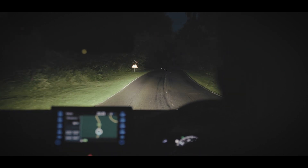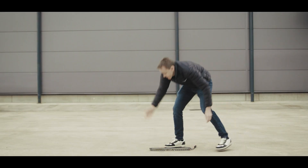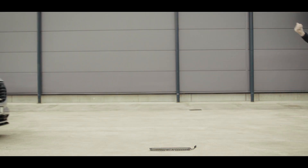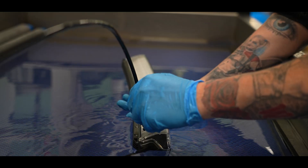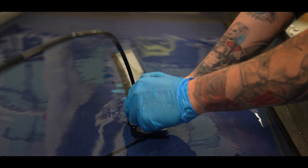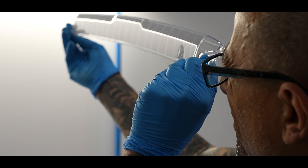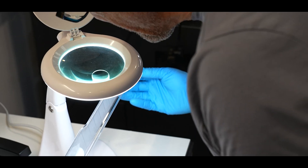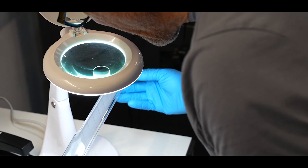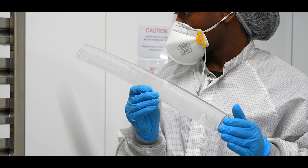Glide comes with a five-year warranty and is manufactured at our UK facility. It is every bit as tough as any other Laser product. The lamp is IP68-rated, meaning it's fully submersible to a metre and a half for more than 30 minutes. The lens has a lifetime guarantee against breakage during normal conditions, and it's a 3mm formed polycarbonate lens with an in-house hard coat application.